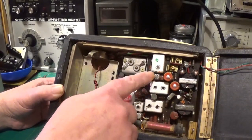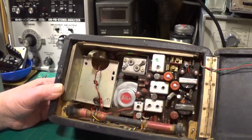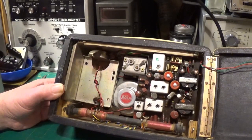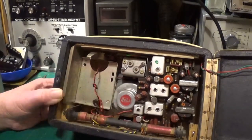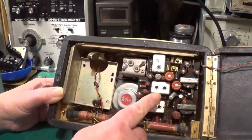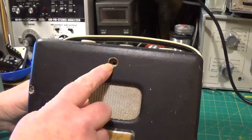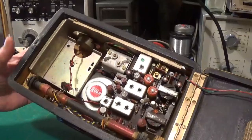I'm not so worried about the Hunt's capacitors at the moment — they are plastic encapsulated and seem to have more trouble in valve sets where they get hot and cold and the plastic just comes off. This one has got a very wobbly tuning capacitor. I'm pretty sure someone's been in here before — in fact I know so, because all the screen leads have been cut on the AF117s. On the back there's an external aerial input so you could use it in your car, but there's no headphone jack on these.